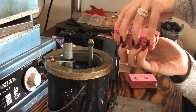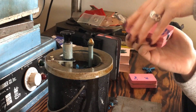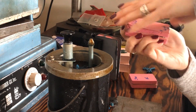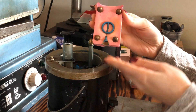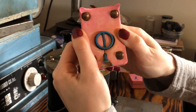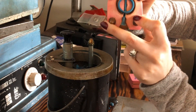Generally some molds work best if you open from a specific direction depending on how you placed the model in the mold — that's usually the side we put our label on. I'm pulling at the corners and slowly pulling the top off to reveal how well the wax turned out. If it's not great you can always pull it out and chuck it back in the injector. As you can see it turned out pretty well, so I'm going to put pressure on each of the sides, pop out the sprue, and then pop out the ring itself.